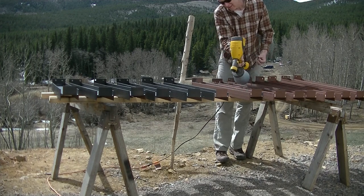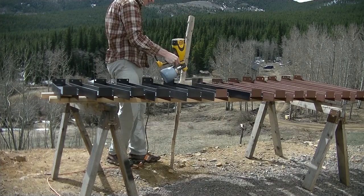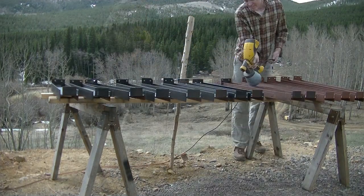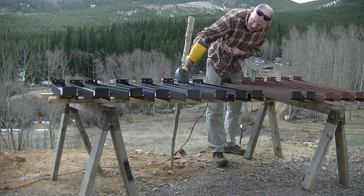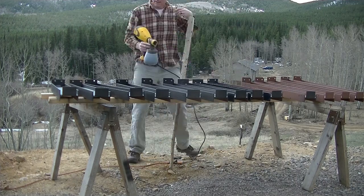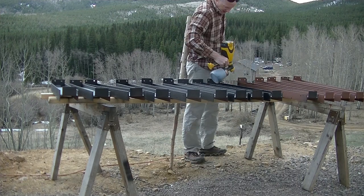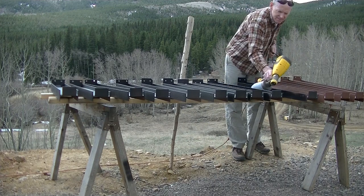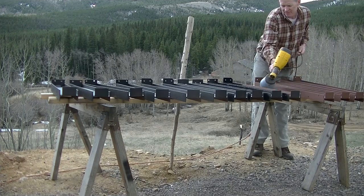Guys, it's Amy from Colorado Mountain Living narrating here as you're watching Brian prep our steel beams for our railing. We're going to be installing the loft railing in this video, and right now Brian is painting the beams a flat black enamel paint. Before, he had put on the primer, that rusty brown color, and now he's spraying on the flat black with a sprayer, and those will be ready for drilling holes, because we're going to be installing cable through the holes in between the posts of the railing. So let's see how Brian gets this ready.